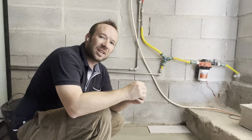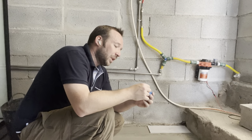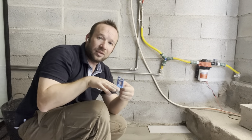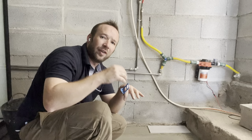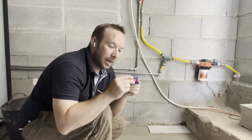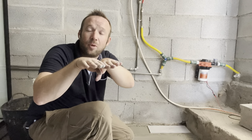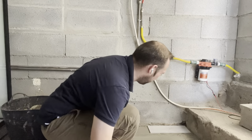I didn't want to go too big because obviously it's a small place — anything super large will look stupid. These spacers go underneath the tiles like this, and when you come to removing them, they just snap off. The wedges go in here, and what that prevents is stepping — where tiles go out of line. That's a nightmare for hoovering, and it looks untidy. We want a professional-looking job.